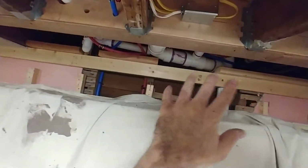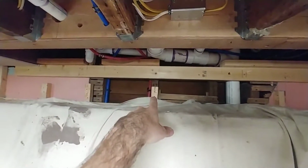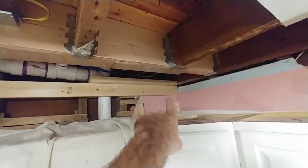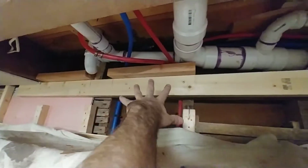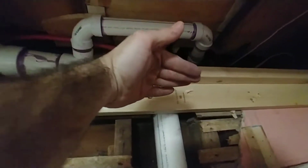And then to cover this up, this wall was packed out for an undisclosed reason at this time. They added 1.5 inches. So I just laid a 2x4 down because that's 1.5 inches wide, and I floated it from the plaster lath that's over here intact to the plaster lath that's over there, and then that just creates a return for this piece of drywall. And then I added some scab blocks on top that'll catch this sheet of drywall on the ceiling. It'll support the edges of it, and it'll give us some place to screw it.